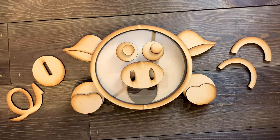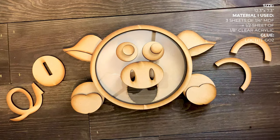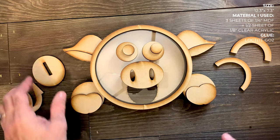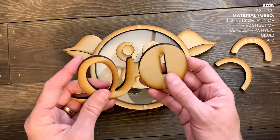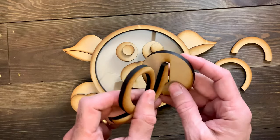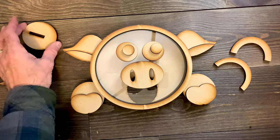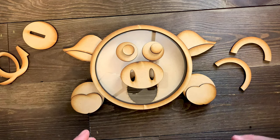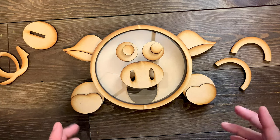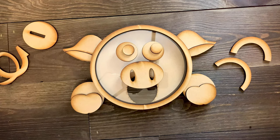I'm going to go over all the pieces of this piggy bank, but before I do, I want to give you a couple tips. The size is about 12 and a third inches from ear tip to ear tip and about seven and a third tall, but you can resize it to whatever you want. The only thing you need to pay attention to when you resize it is the slot for the tail that holds it up in the back — that slot needs to match your material thickness. Otherwise you'll have trouble there. At this current size, it takes me two and a half sheets of MDF and about a third of a sheet of clear acrylic. The thickness doesn't really matter; I just like what the quarter inch MDF produces.